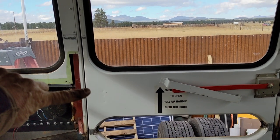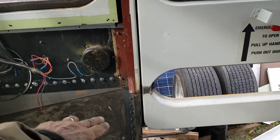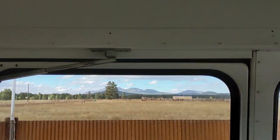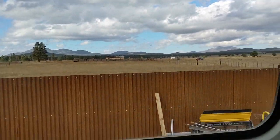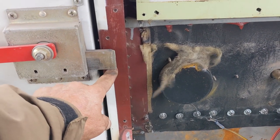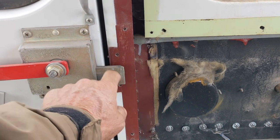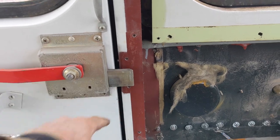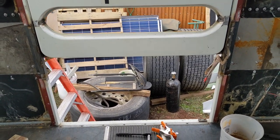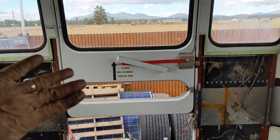Right now I've got one hinge on the outside bolted in, and another one down here not yet bolted in. Once I know where that goes I will weld in a steel plate so that hinge goes into the frame. I just wanted to clamp it in place and make sure my gaps were even — it looks good. I will make a new latch down here, a new latch box — the old one was pretty bulky and had a switch we don't need. I'll make a smaller latch plate, put that other hinge in, then make the door for the bottom which gets trapped into place and will keep their garage secure.